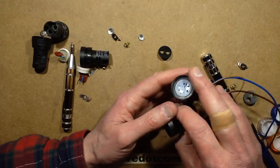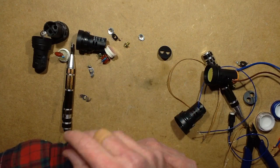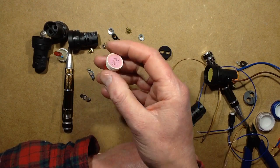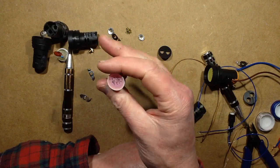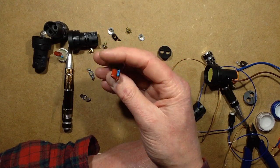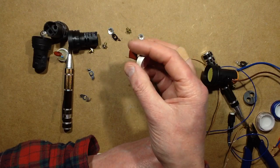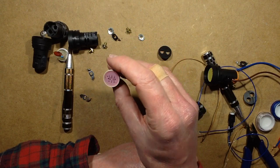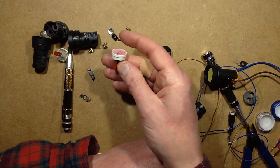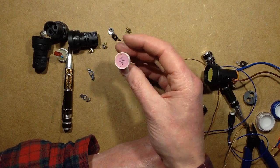But yes, these are visually nice. I'm really disappointed, really mega disappointed at that resistor, that capacitor rating. I mean, even in 240, as I say, that's just taking the shine off that. I could change the capacitor, but that kind of defeats the point. I think I may get some more of these and just take a look at them and see if they're a similar arrangement. I'm pretty sure the 250 in that is the 250 volt rating, so that's not that great. It suggests that maybe that resistor will be needed at some point.